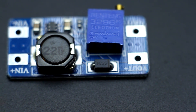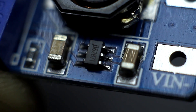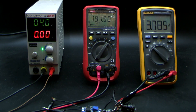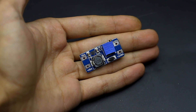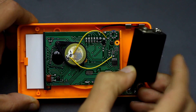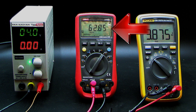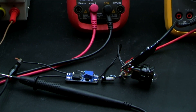This converter was modified by many for reducing pulsations. As a rule, reworking concerns only the input and output parts, by addition of smoothing capacitors and so on. Today I want to show you my version of remaking this board, which will firstly essentially reduce the idle current, and secondly protect the converter from short circuits and overload. Very often a converter of this type is used to feed a multimeter from a low voltage source, to save money on 6F22 batteries. Consumption of 1 to 1.5 mA in idle mode is too much — my version will reduce that current to about 60 µA. It's a super economical converter that can be left turned on as long as you want; it consumes almost nothing.